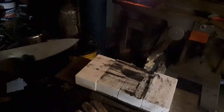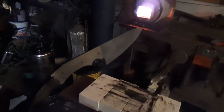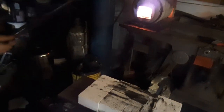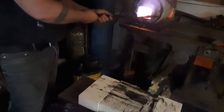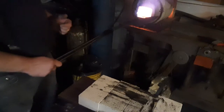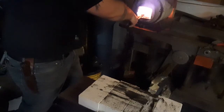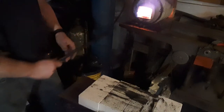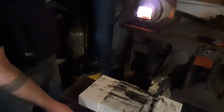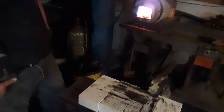Alright, we'll pick it back up where we left off. Look — that blade is black. It's going to be magnetic again. So I'm going to turn this camera up just a little bit so you can see back to the forge area. There's a magnet over here — you hear that? It sticks to it again. So it doesn't stay non-magnetic. It's going to go up past critical and then back down below critical again, so you've got to put it back in there. All we're doing is trying to line up and get the grain structure real fine in that steel, in case we put stress in it.